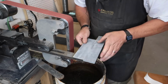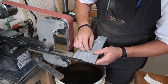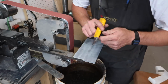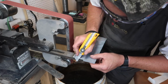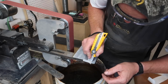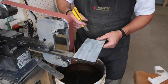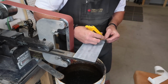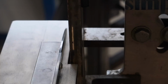And it does a couple things. First of all, it gives you a much smoother surface for your grinding jig to move on. But it also protects the work rest a little bit. It seals it in from the water and stuff like that. So it's pretty cool stuff. I don't always keep it on there, depending on what I'm grinding. But I've had it off for about a month, and I thought, you know what, with this jig grinding I have coming up, I'm going to need it again. And now our jig should move across there real good.